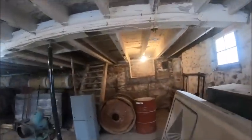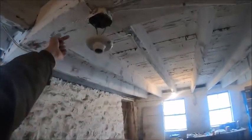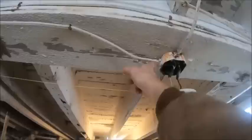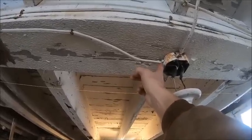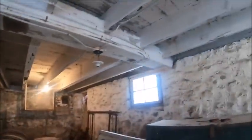And then I could run the wire down that beam over here to my incoming panel, and then come out of the switch into this junction box and tie everything together. And then this wire, which is the one feeding that half of the barn, cut back here and hopefully come back in and just run two through this crimp lug and tie everything together in this box. Because basically anything I do right now is going to be a band-aid.